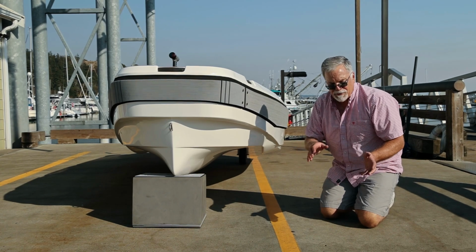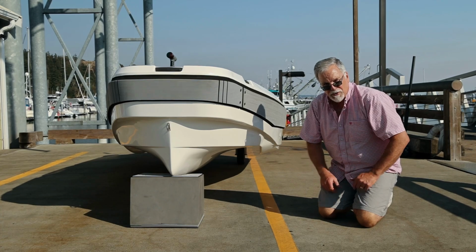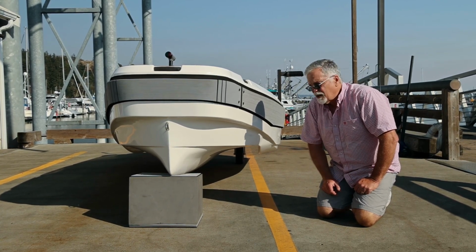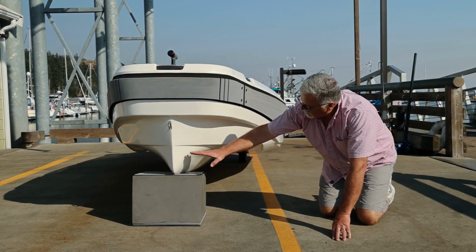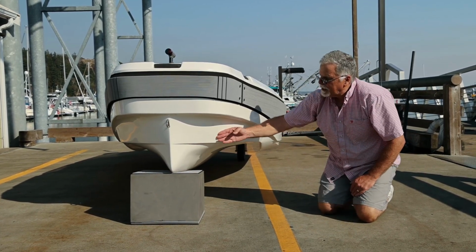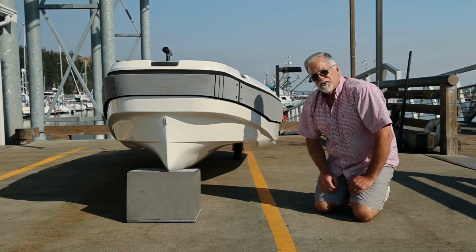As a tender, you're stepping on the boat and all kinds of things all the time. You don't want a roly-poly boat. You want it as stable as you can get it. And this hull does all of those things really well. What we start with is a real plumb bow here. We'll show another shot of that in a second. And the waterline is about in here, and you've got a spray knocker here, and in big waves, you have a really big spray knocker here. So the boat's really dry when you're underway.